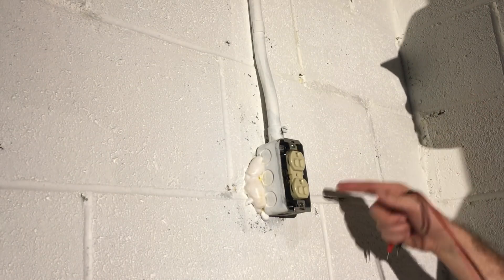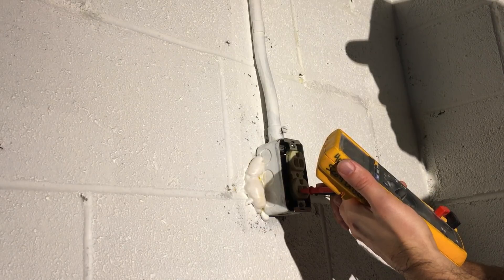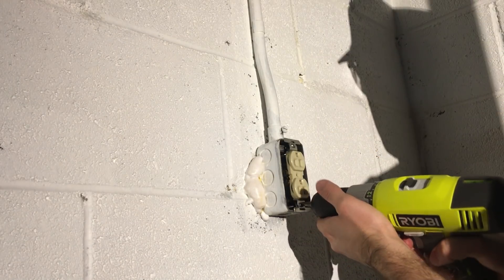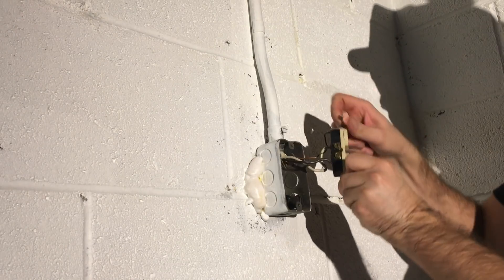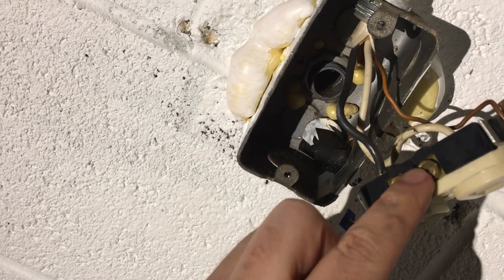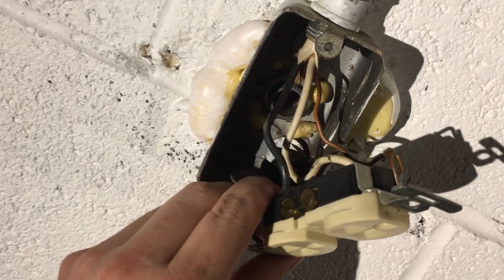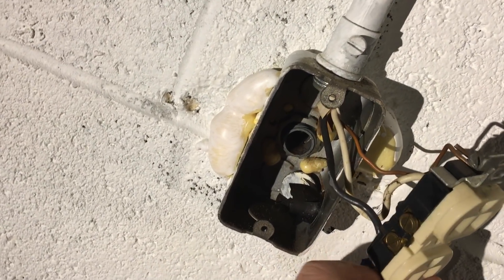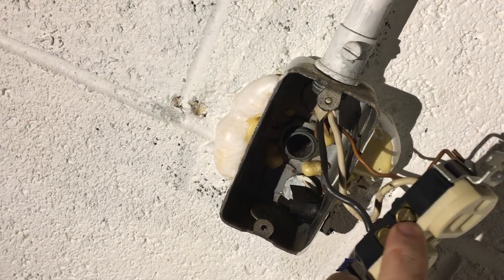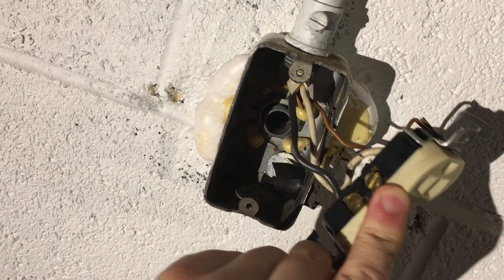This is the outlet on the inside opposite the one on the outside. First thing — hit the breaker and make sure there's no voltage here. I'm going to run my new wire through that conduit hole and tap into the extra connector screws for the hot and neutral lines, and I'll run a pigtail connection for the ground. There are some circuits where you're not allowed to tap through another device — I think that's with multiple hot circuits that are different. I'm not a licensed electrician in any way.